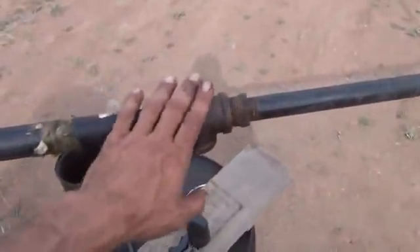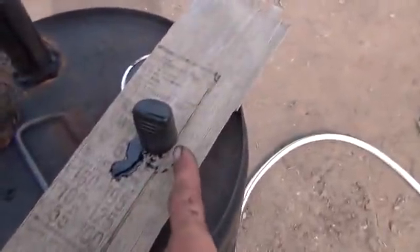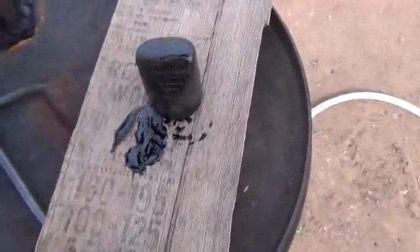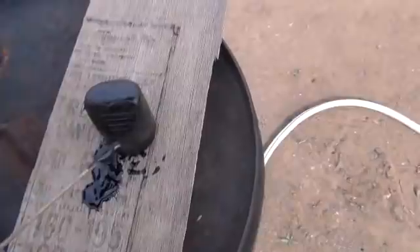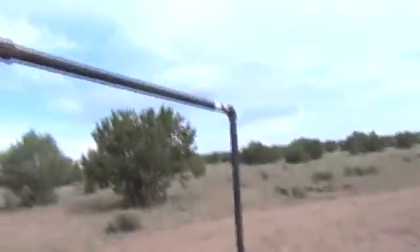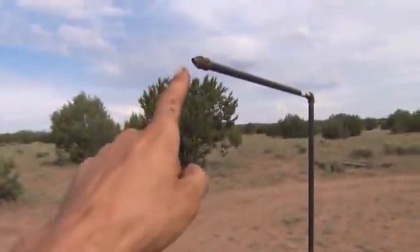In the last video I was burning it with a bunch of wood inside the reactor. I want to show you what the crude oil looks like. You can see I pulled the little plug I showed you in the first one. Here's the crude oil sitting there that's coming out of this system. It's a nice crude oil — very, very thick, nice and black. This is going to be the thickest and heaviest grade of the crude oil that we catch throughout this system. This is the first stage of recovery — first stage of capture of bio crude. The second can will be a little bit better refined stage of crude, and then out of the third stage, after it goes through the two radiators or maybe a single radiator and a condenser, we'll have a much more refined state of crude oil.